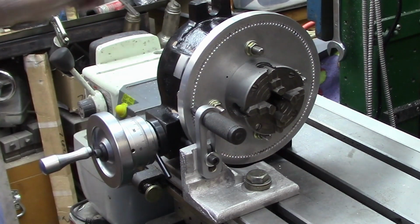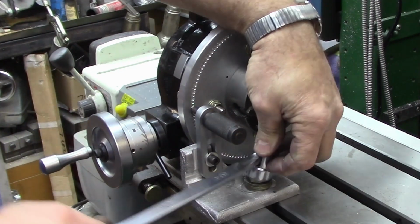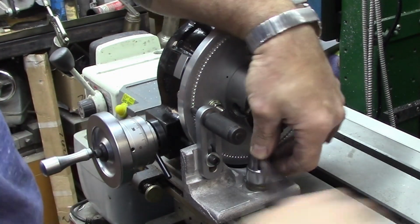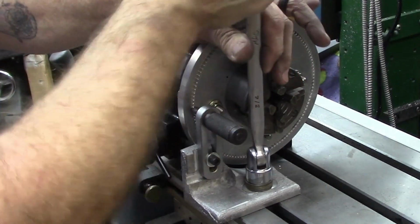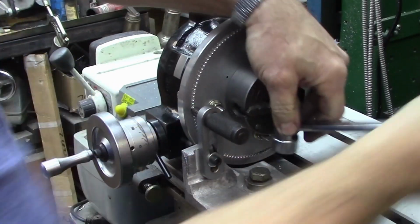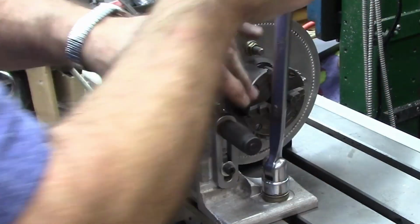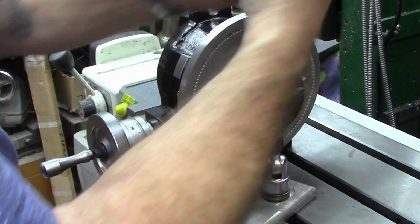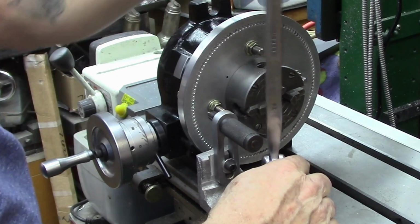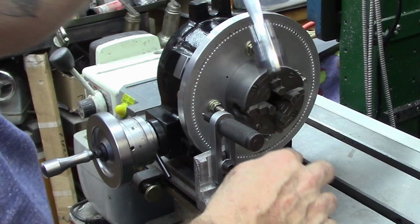and it's going to work just that well. So I'm really happy with it. I think it's going to work fine after my first little bobble with this. But you know, I could have cut this gear blank on the CNC, and I had somebody that said they'd like to see that. I may go back and cut one that way, or cut a different gear blank that way, and show that. But the process is the same either way. And the digital readout on this mill gave a real nice, consistent hole circle. I've checked it all out and checked dimensions and everything, and I'm very, very pleased with it.